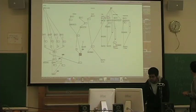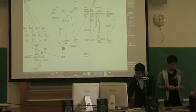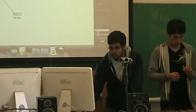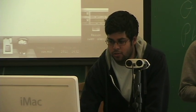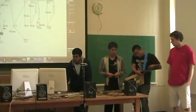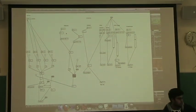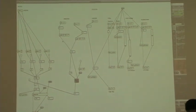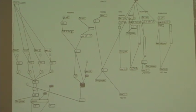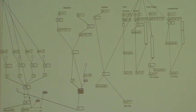The lasers come in as digital inputs — just a plain on and off — and that gets filtered through here. Over here we have the lowest string, which produces an E2, and all the other strings come in with a certain increment, like a real bass. Over here we have the two ribbon controller sections on the neck. You get a reading of the distance of where exactly you're interrupting the ribbon, and we scale it so it feels like a fretboard. That produces a number which just gets added to the note produced by the string.